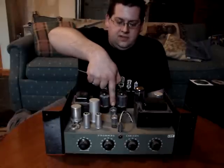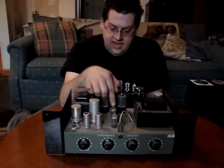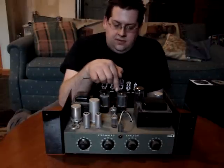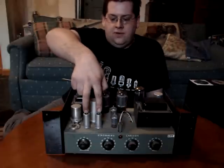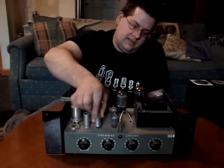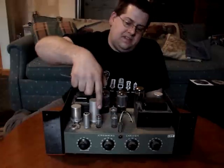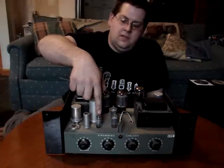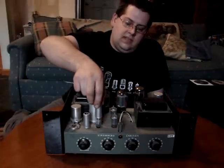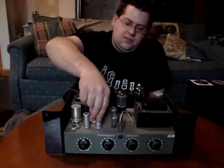This is what converts the audio AC signal in into a push and a pull tube. These two are preamplifier tubes. They have a metal shield over them to keep out noise because they're very high gain — these are microphone preamp tubes, so the gain has to be very high and they would pick up a lot of noise, so they put a metal shield over them to keep the noise out.